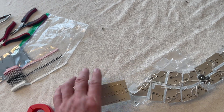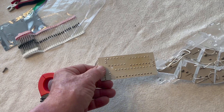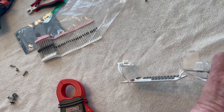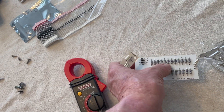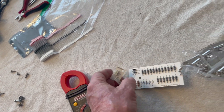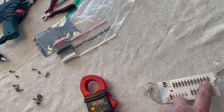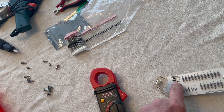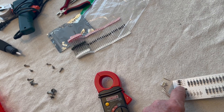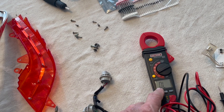It's a very basic circuit. First, check that all the wiring is correct and nothing is open. Then on the circuit, check that there is no overheated element or resistor. Usually that's the only way resistors fail, but since we have very low power here, I don't think they will have any problem. What I found is that one of the four rectifier diodes was open, so with the tester I checked that.